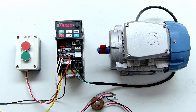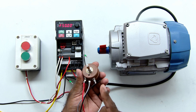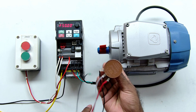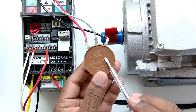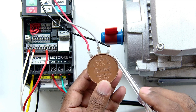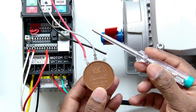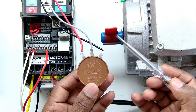If you want to give a signal to any VFD through which you want to operate the motor from some other place, then you will have to use this kind of potentiometer. This electrical device is called a potentiometer. In a potentiometer you get three terminals in total. On the back side of the three terminals you can see the entire diagram and symbol. Terminal number one is for positive power supply, terminal number three is for negative power supply, and from the middle terminal you get an output signal in the form of voltage. The input voltage given will vary the output voltage.